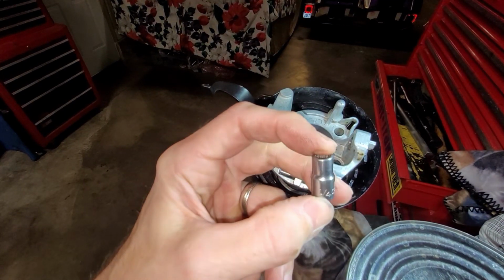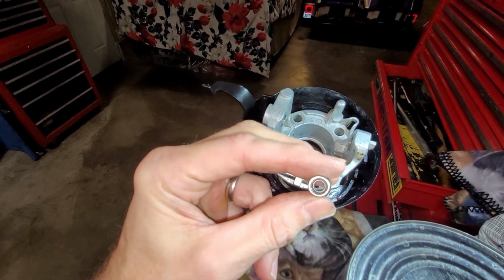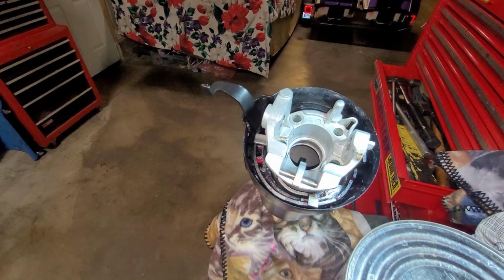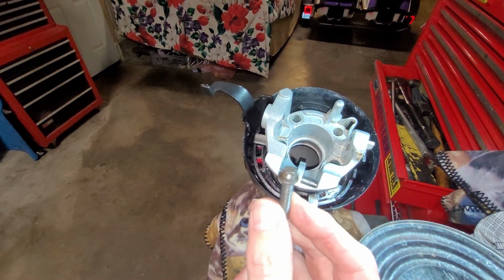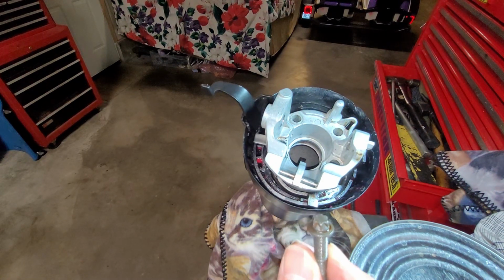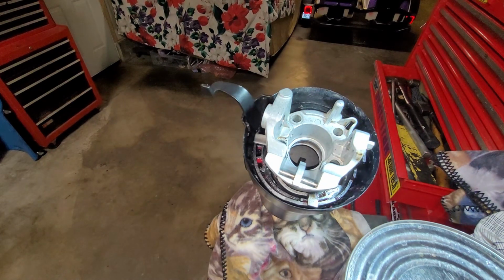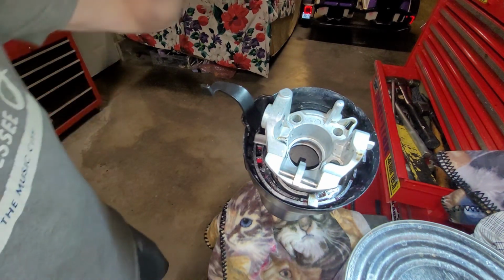So now I've got my 1/4" 12-point socket. Going to use this to put the 4 screws into place and tighten them down. So you'll want to use a little bit of Loctite on that, because this is something that you absolutely don't want coming loose, because believe me, there is a lot of stuff that goes on top of this that you'd hate to have to undo to tighten these screws again.